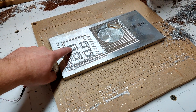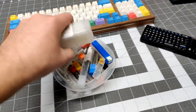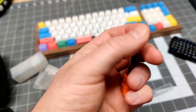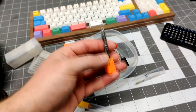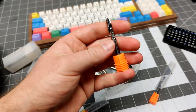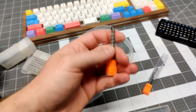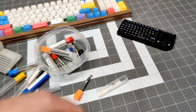I actually bought two of the $16 ones. I broke one — the tip of the flute is broken and I cannot cut with this end mill anymore. There's a little bit of aluminum clogged there too. It sucks — it was $16. But the second one I have is what I used to cut the full depth of cut and it practically looks brand new. So once you get your feeds and speeds down and let the cutter do what it's supposed to, it stays as sharp as the first time you used it. With a dull tip, you won't be able to get a good start in aluminum and it just won't cut for you.